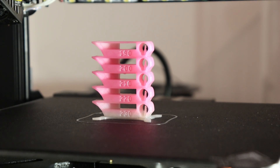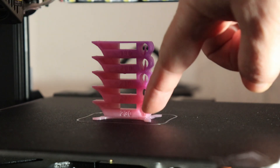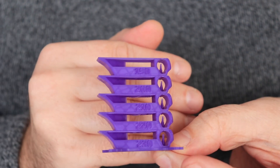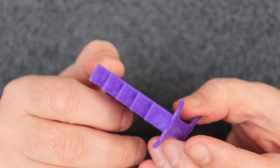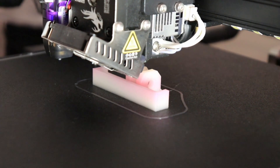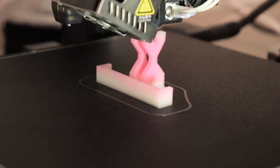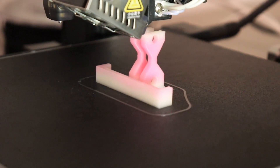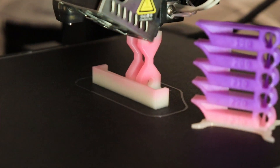Printing is finished and I want to create a time-lapse of the cooling — this is sped up with a time-lapse of approximately 10 minutes. Interesting — the top is cooled down, only the bed is still hot. Printing is without any problems, like regular PLA. Absolutely no stringing, maybe just a little bit at higher printing temperatures. The overhang and bridging came out perfectly, so I will print all test objects at 220 degrees Celsius. Approximately 5 or 6 millimeters is heated by the bed, so keep this in mind next time you print ABS without enclosure — objects smaller than 10 millimeters shouldn't have a problem. And this is the color when it completely cools down. It is interesting to see the color transition in less than a minute.